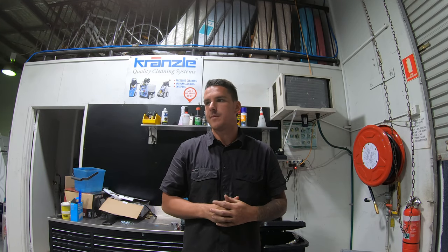Now that I've got it all shiny and looking pretty good, the next step is to actually shorten the tray. It's an 1800 tray, a bit long for me - I like short trays, I think they look tough. So I'm gonna take a slat out; a slat's 150mm, so it'll go down to a 1650mm tray, which is around the sort of length I want.